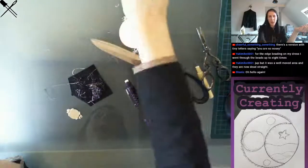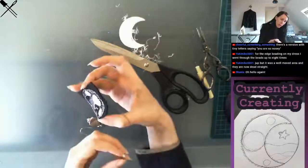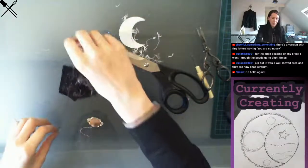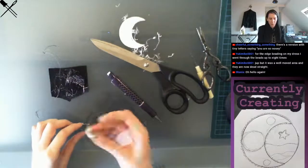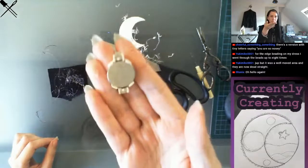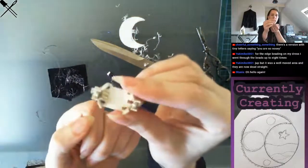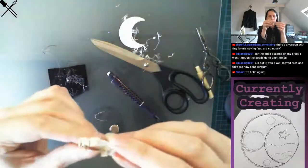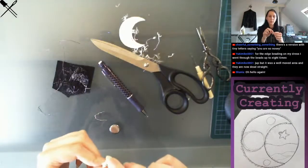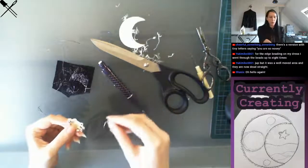So the pin is now out. It's still gonna go on the back, but it's not gonna be part of the circuit. So instead, if I remember correctly, this is the plus and this is the minus on the LED. I'll double check that to confirm before I connect it to the wrong side of the battery. There's one resistor that needs to go in there, this little guy. And then this is the battery cell connector pocket. So I can stitch this on because it's got some holes in it. And I'm thinking that to connect these threads to them, because I don't think these will solder well, I want to make loops on this and on one of the ends of the resistor that I can then stitch the thread through. So that's kind of the plan.